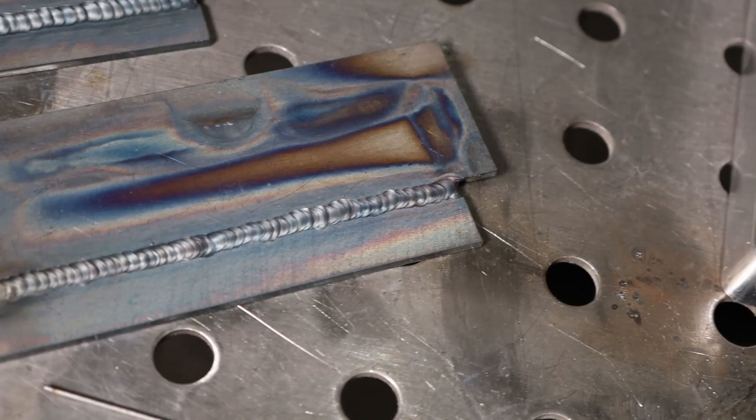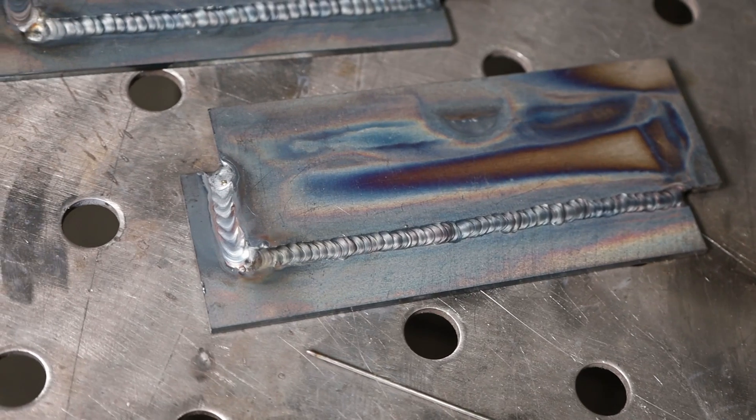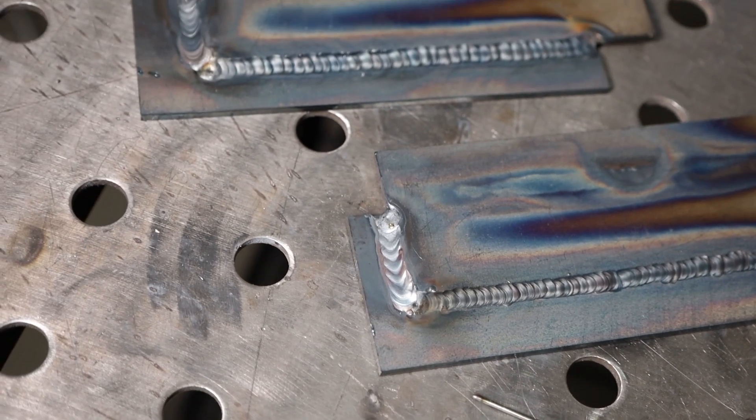When I come up to the end of the weld, I just snap out of it since there's no way to turn off the electricity. Looking at the electrode after seven or eight beads and several starts, there's a little bit of wear but not bad. Now I'm running lap joints — the bottom line is a plate sitting underneath, and I'm welding them together where they overlap. You can see it just melts away a little on that top edge as I move along, giving a peaked-and-valley look as I size the weld similar to the plate thickness.